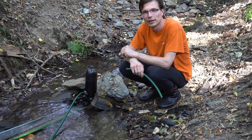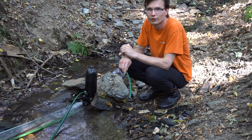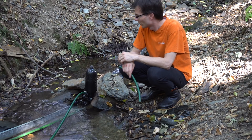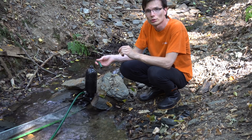With this RAM pump we had a problem — there were some air bubbles in the delivery pipe, and the water pressure wasn't so high because of that. We solved the problem by putting the RAM pump into the water.